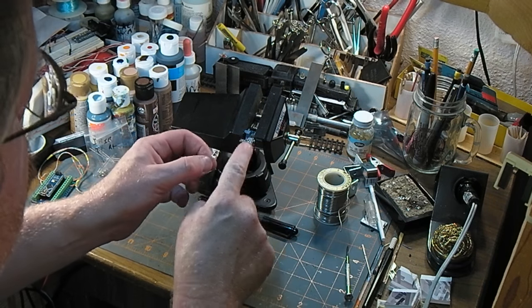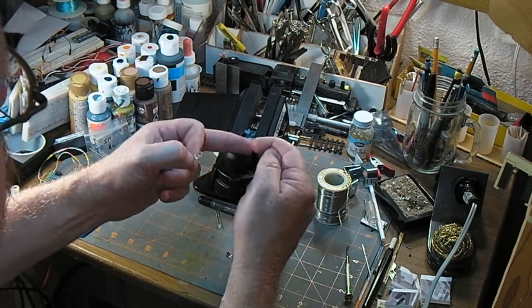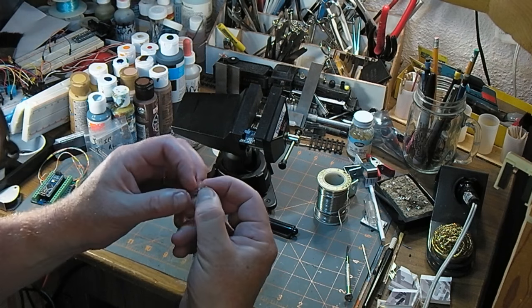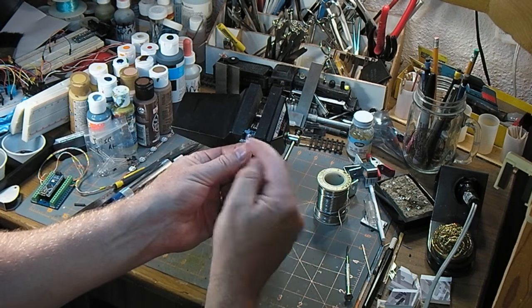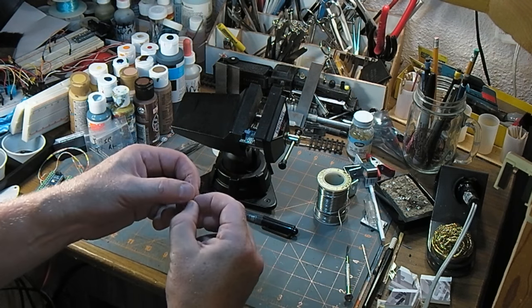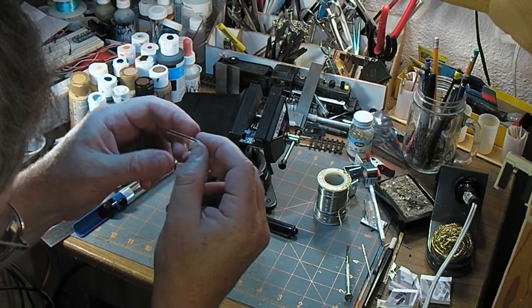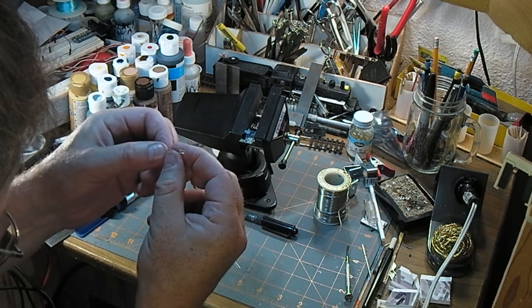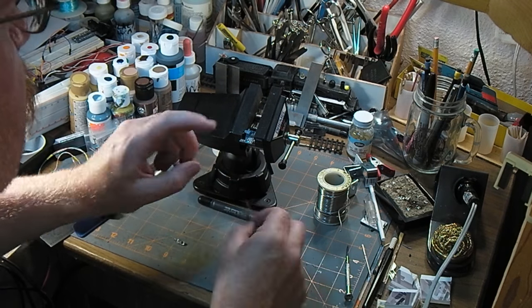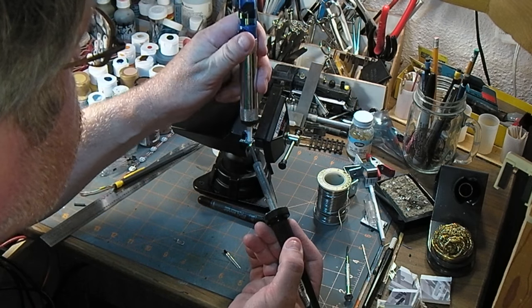The other thing I looked at earlier is the polarity. The flat spot on both of them is to the middle. The flat spot on this one — you can't see it, but it's on this side — it was in the middle, and the flat spot on that one is in the middle, which indicates the polarity. Same thing on here: the flat spot is on the short lead, so that's going to go to the middle. And then I've got to solder-sucker those holes so I can get it in there easily.